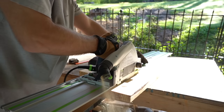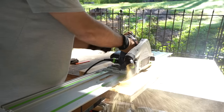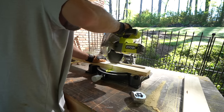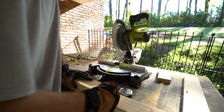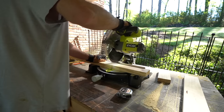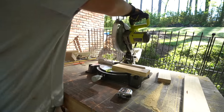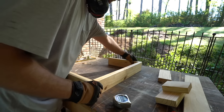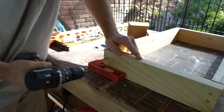I'm gonna use my track saw — you can use a circular saw, a string line, or a table saw, but I prefer the track saw. Now we're gonna cut our pieces to their final size. I want my concrete base to be 24 inches by 12 inches. Our long pieces are gonna be 24 inches. Our short pieces on the outside are actually gonna be 15 inches, because you have to accommodate for the thickness of your material. Those are inch and a half each, so two pieces of inch and a half, three inches plus 12 equals 15.